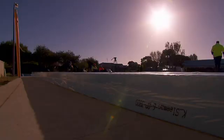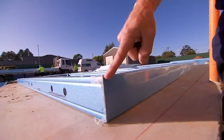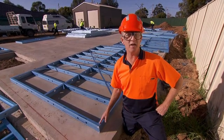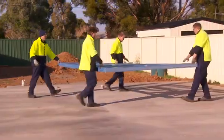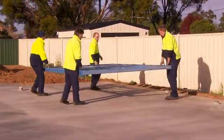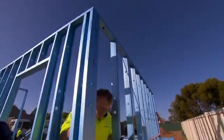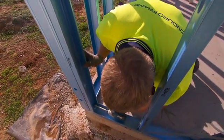Mark a chalk line on the inside of the wall positions on the concrete slab or platform floor. Where wall bottom plates are not pre-painted, an impermeable membrane such as polyethylene should be installed under the wall frame to isolate it from direct contact with the concrete foundation. The membrane should extend up the weather side of the flange of the bottom plate. Unpack and lay the wall frames close to their intended position according to the drawing. Starting from one corner of the building, stand two frames to the chalk lines to make a square corner. Screw the panels together using hex head screws at the top and bottom plates.